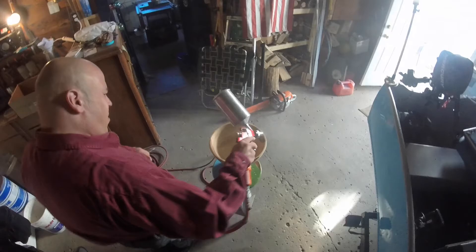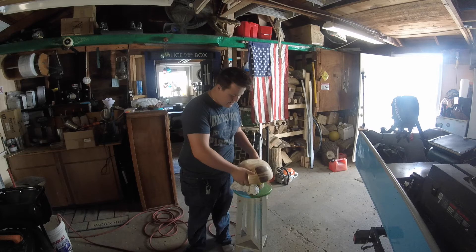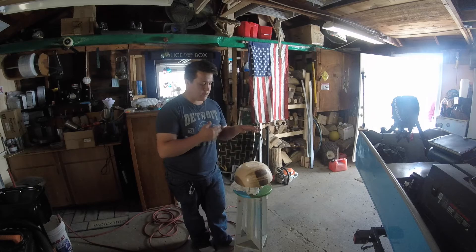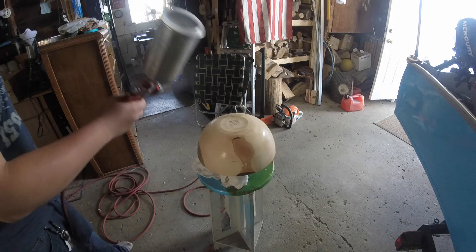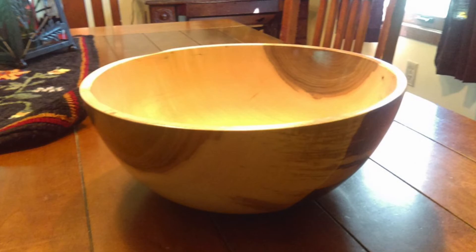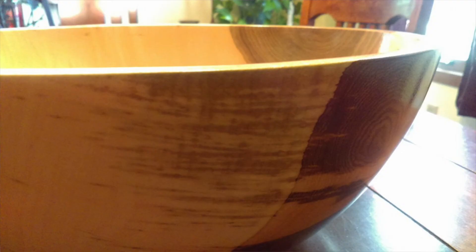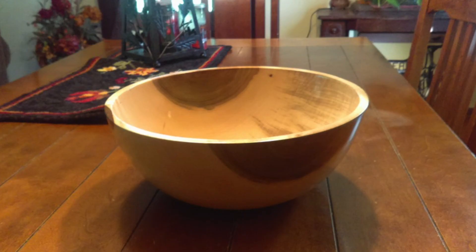The inside has got a finish coat on it — super glossy, very nice luster. Before that finish coat I took 800 grit on a small sanding pad to knock out all the texture and high spots, then tack-ragged it off. I'm going to go ahead and spray on another finish coat. That's it — I don't have the bowl to show you right now because it's already been given to the guy running the silent auction for the food bank of Eastern Michigan. I'll put up some photos of the finished product — it came out really really well. If you thought it came out nice, leave a comment below, give this video a thumbs up, subscribe, and I'll see you all next time.